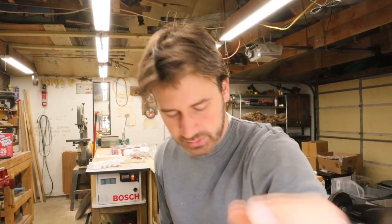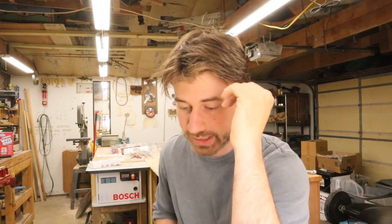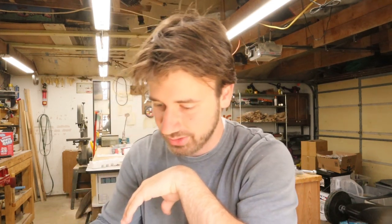It's been a little while. The hot plate is to keep the molds hot while you pour the soft plastics, and that keeps the soft plastic against the aluminum hot — that way you don't get cold cracking. It makes the layers all seamless and smooth. Chris Jones did a video about hot plates and soft plastics, and I needed to get one. I'm going to try this method out. I'm using a thermometer to keep track of the temperature inside the cavities.